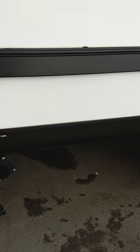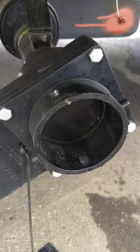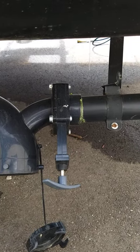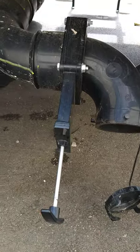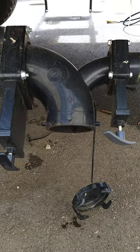Your dump valves — you've got two gray tanks on this one. This one here is called a galley tank, but it's still a gray tank. The valve slides in; your hose goes on here, and the other end goes into the dump station, and that dumps your galley tank. Over here you have a gray and a black. The black tank is toilet water and waste; the gray tank is sink and shower water — in this case your vanity sink and shower. The other will be your galley sink. You'll hook up your hose, put it in the dump station, and dump the black first. Then after it dumps, you'll dump the gray, because the gray water is cleaner and it helps wash out the hose.